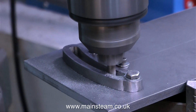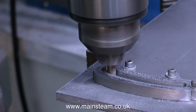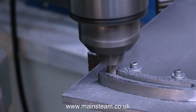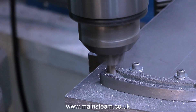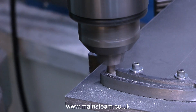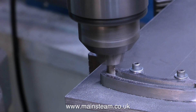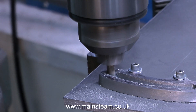And now, as a special treat for the viewer who wrote in asking to see some parts of the sequence in real time — here it is. This is in real time. This is the part where I've moved the main handwheels on the milling table to widen the slot in the expansion link and take some very fine cuts. In this clip I'm using my Henry vacuum cleaner nozzle to vacuum away the chippings so I can see exactly what the cutter is doing. And this next pass should give me quite a good finish.